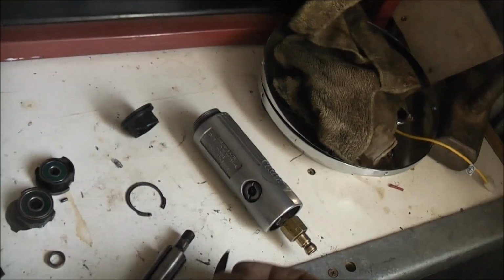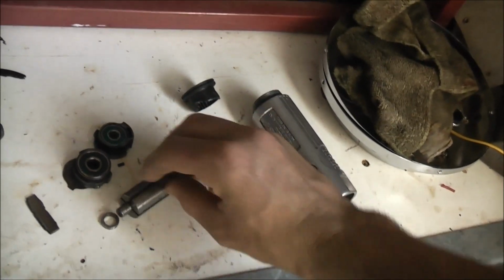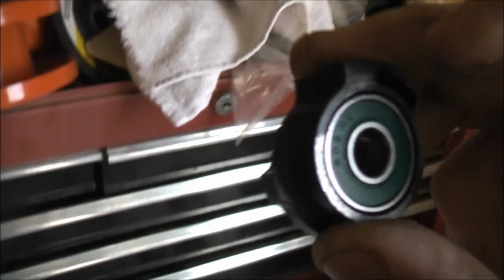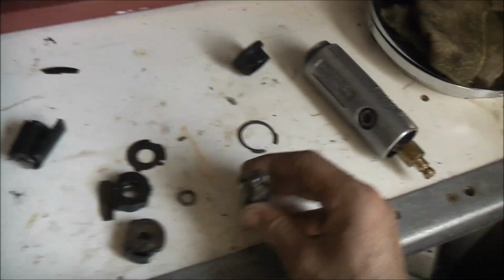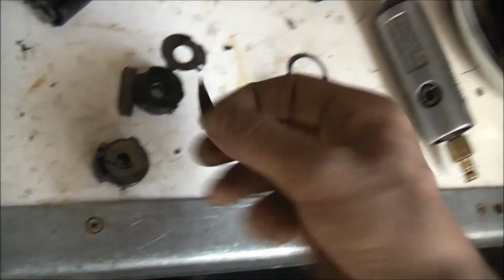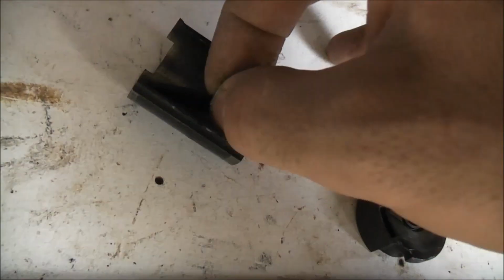There are these vanes which go inside here, that way. They sit like that. There's 4 of those. Now air goes in underneath this bottom plate. There's a top plate, this is the bottom plate. Air goes in here, is directed on here, and is forced behind the plate here. It pushes the plate out and this is forced to spin. And these blades fly out and these vanes push hard up against that wall there and spin.